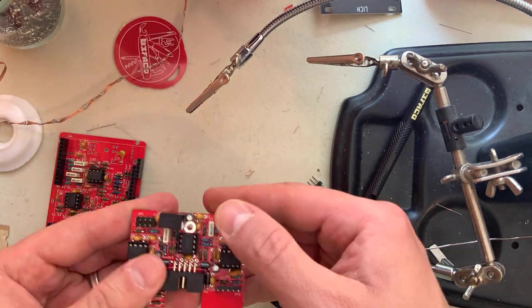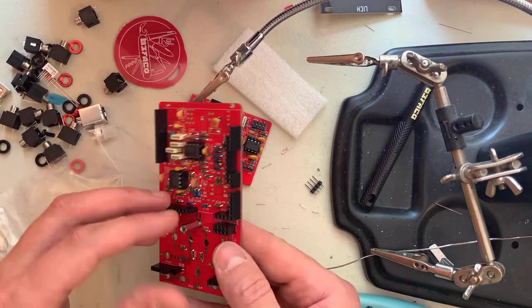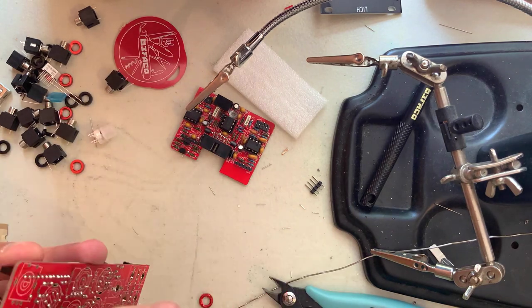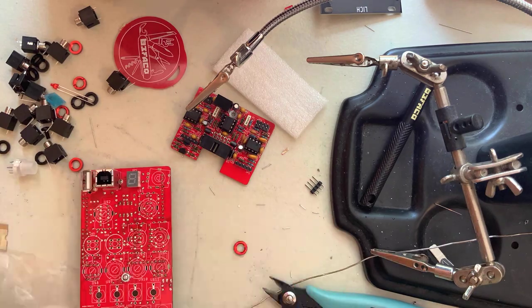Now let's open the mechanical components bag. Secure the 12mm spacer into the control PCB. Use the included nut to secure it. Now place the USB connectors, but don't solder them yet. And then place the 7-segment display with the dot facing down.